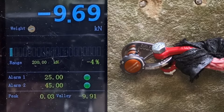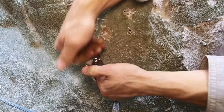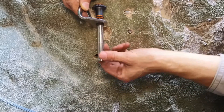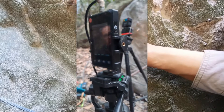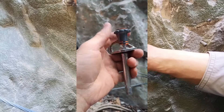We loaded up to around 9 kilonewtons — actually closer to nine. There's a little slight bend in the middle of the shaft; we took it a little too high. We took this thing up to 9.91 kilonewtons but it's not really retracting anymore.